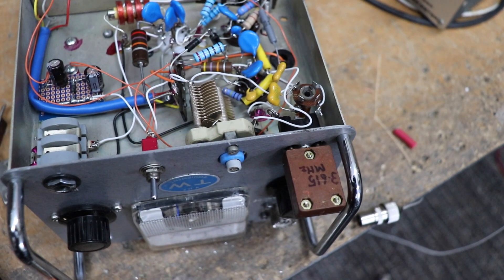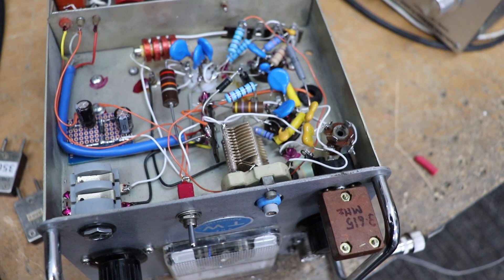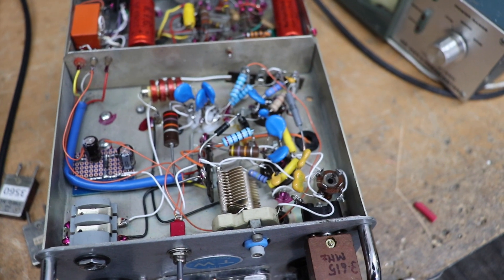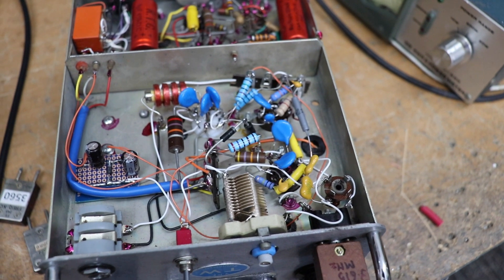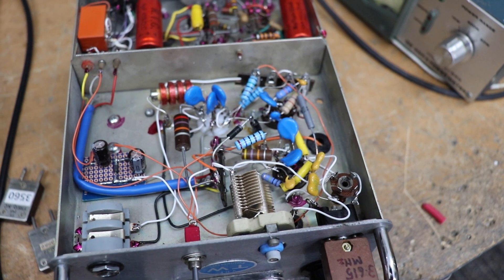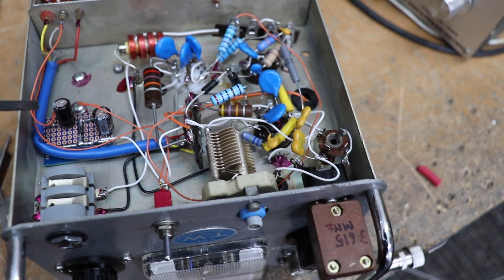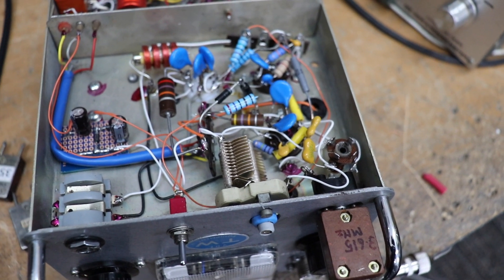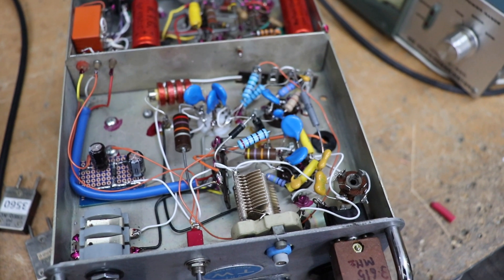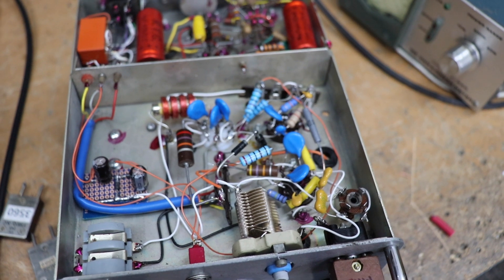Let's have a look at the bottom. A couple of things of note here: that's the grid tuning capacitor — or anode tuning capacitor — to optimise grid drive to the PA, so I can change back as I change frequencies, going from 3615 to the CW end of the band. The other thing I've done: what you see there is a little voltage doubler which takes 6.3 volts from the heater supply, voltage doubles it and rectifies it, so we've got 12 volts DC.